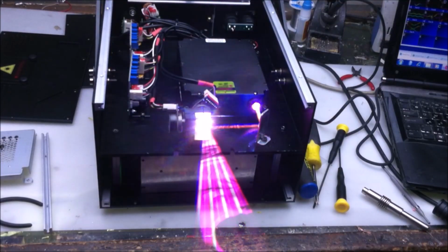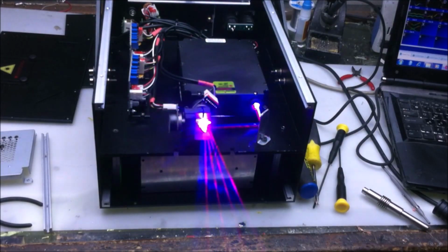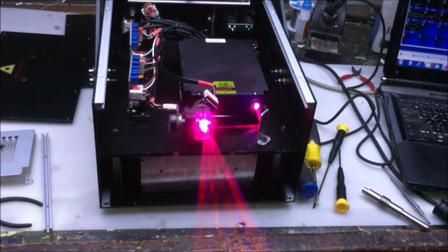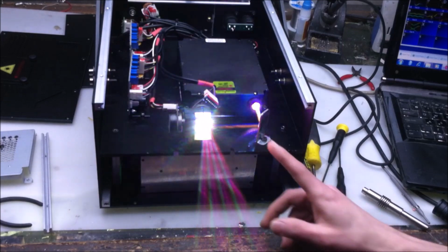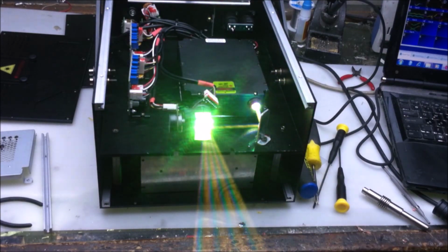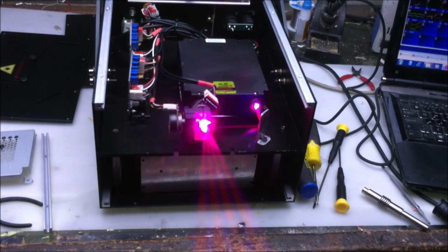After a few hours of working on those cheap bend-to-align optics inside of the laser head, everything is now working as it should be, and it's time to put the laser back together. But before I do that, I want to point out that there's no shutter inside of the laser, nor is there a scan fail system, and that just shows you how much they prioritize safety inside of these lasers.